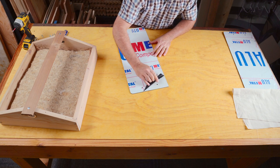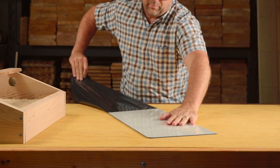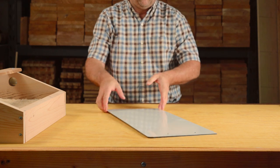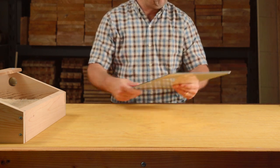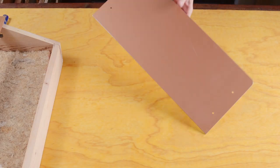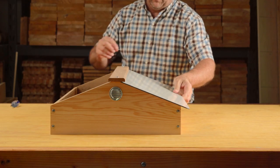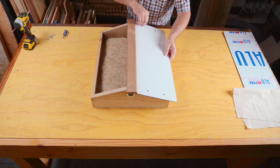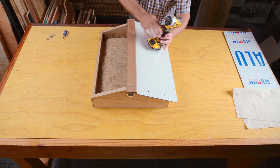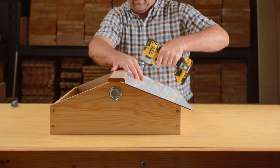To paint, remove and discard the plastic protection from both sides of the aluminum panels. Use steel wool or rough sandpaper to scuff up the side you want to paint. Then paint them and allow them to dry completely before moving on. Decide which color of the aluminum panel you want facing up and place it on top of the assembly. Then slide it up snugly into the ridge cap. It is very important to slide the aluminum panel up into the ridge cap snugly and not leave space for bees or any other insects to get into your roof.